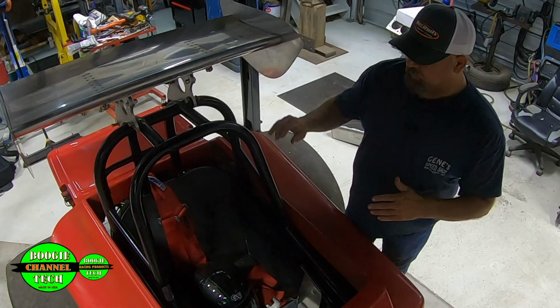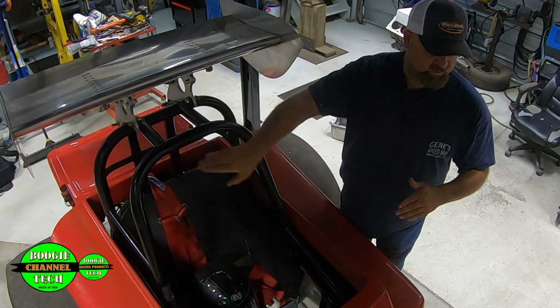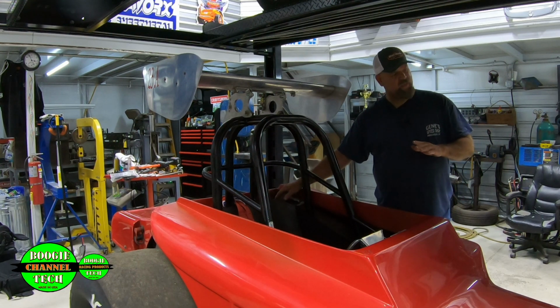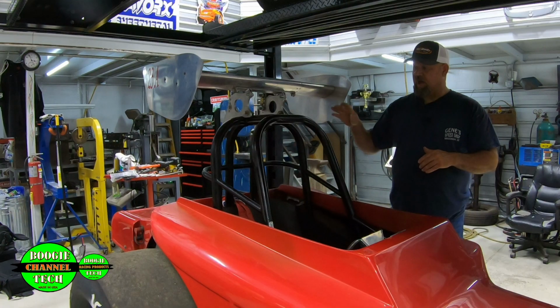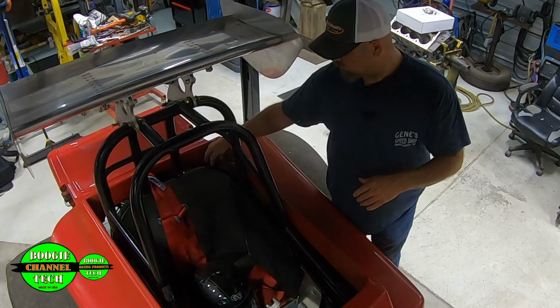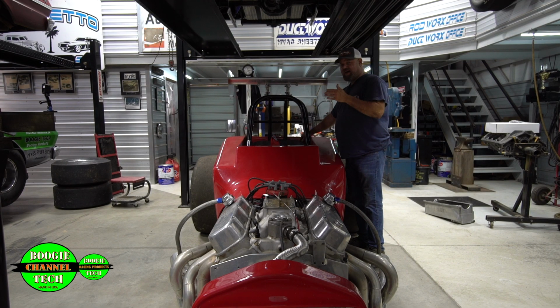What we're going to do is we're going to raise the funny car cage. His helmet, literally, he's hitting the funny car cage. So we're going to raise it up. Now, here's the problem. Depending on what the shoulder bar thickness is here, it's going to depend on what we can do with this cage. Right now, it is so close to legal limit, we got a problem. If this shoulder bar is .058 material, chrome moly, if it's .065 chrome moly, then we can cut this cage off, we can put him in a .083 cage, and we can make it as high as we want to.